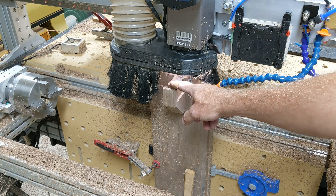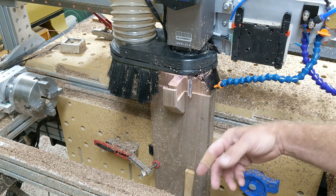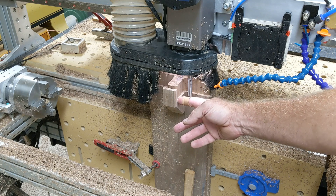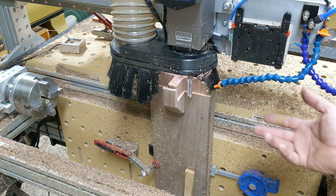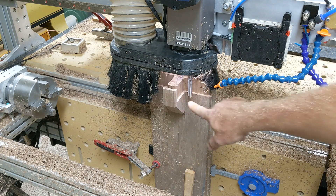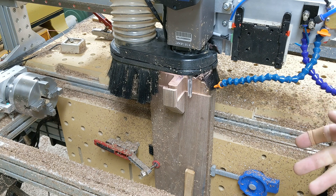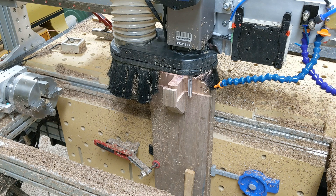I made a mistake creating the vector — I made the support braces on the sides too big, putting a larger shoulder on them than I originally intended and forgot to update the toolpath. I could just cut this off with the bandsaw and clean it up with a chisel, but instead I'm going to manually use Mach 4 to step through and shave it off, because it's faster than modifying the toolpath.